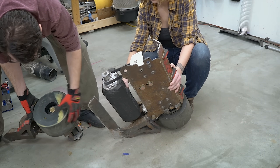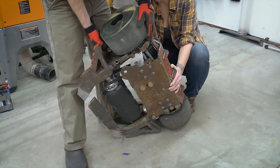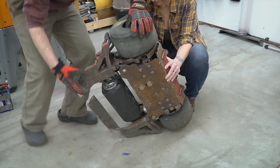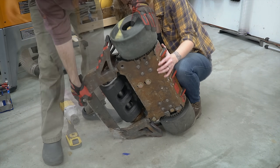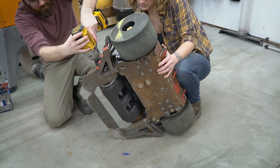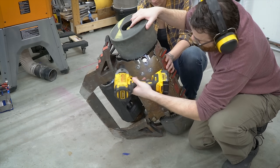I'm not really sure if it's harder to pull off the drive side or put it back in — they each have their challenges. When you're putting this back on there's not much to hold on to because it kind of slides inside the body. The only things you have to hold on to are that big fin, which is sharp and awkward, and the huge wheel, which spins every time you try and grab it. The strategy is to find that little cup in the front and make sure it gets onto the weapon shaft first — once that gets seated, everything else will fall into place. At the same time you've got to make sure you're not pinching any wires or fingers.